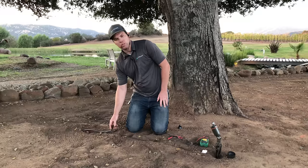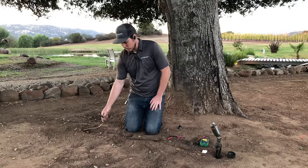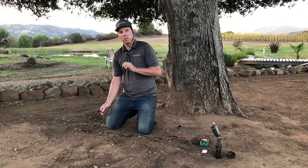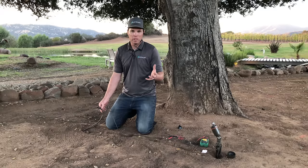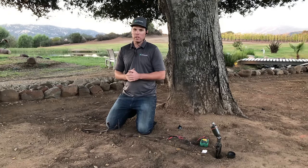Many times we see that connections are not waterproof. This is a huge problem because in outdoor environments, even if it doesn't rain much where you live, moisture still gets in from the air and from sprinklers. Moisture travels throughout the copper, starts destroying things, and makes the connections very weak. So check your connections — if it looks like there's any damage, if the wire is green or black on the inside, cut it off and replace the connection. Most often this will fix the problem. We recommend using a dry splice connection. 3M makes a good one and so does a company called Drycon. We refer to it as a lifetime connection because it really lasts a long time — I've seen them at about 30 years old and they still work. It holds tightly, you can't pull it apart, and it's waterproof.